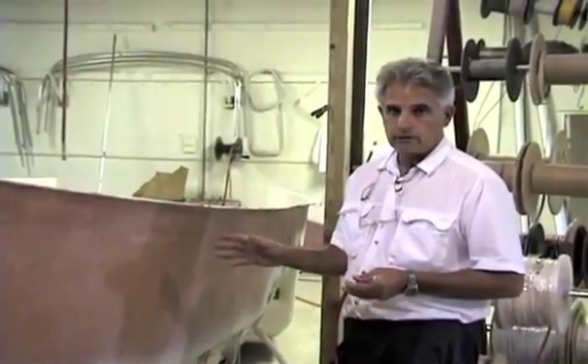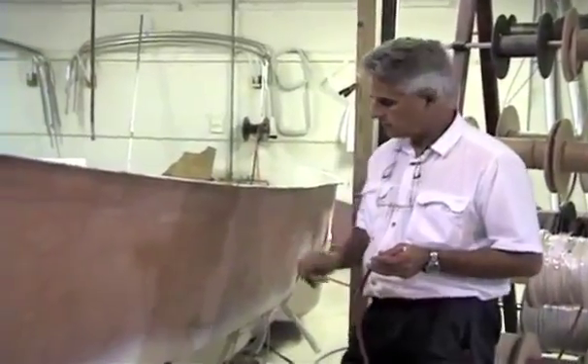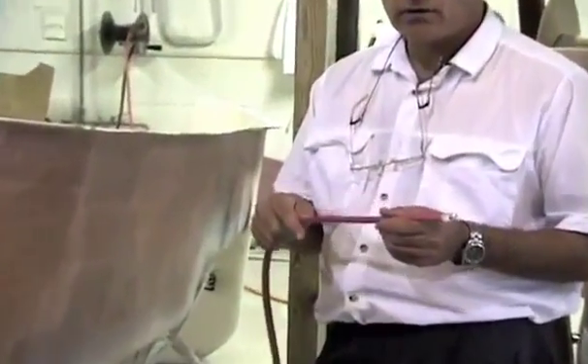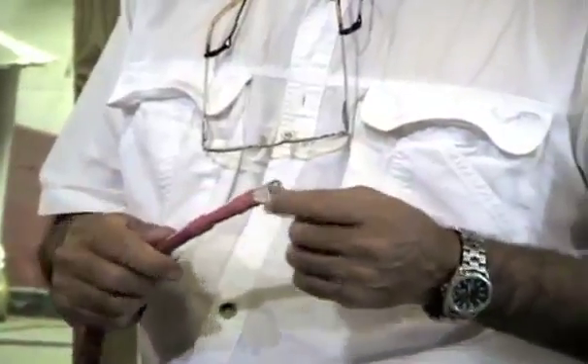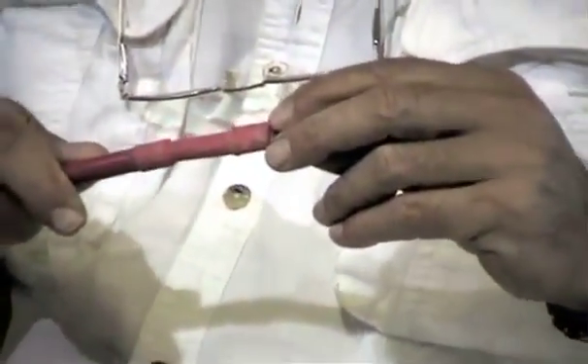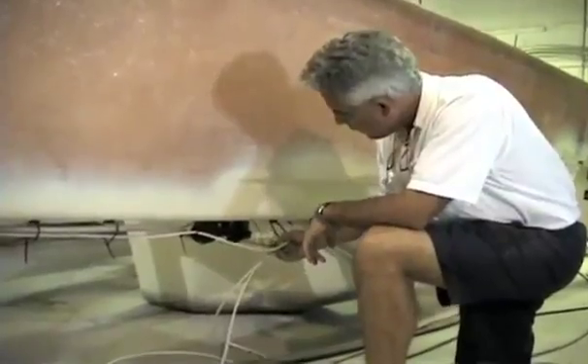While we're talking about the liner, it's a good opportunity to discuss the electrical and plumbing systems being installed right now. Every piece of wire that goes into our boat is tin-coated copper, and every fitting at the end of every wire is also tin-coated copper. This will prevent the green corrosion effect you'll see with old electrical connections in a boat. Every wire we run is a jacketed duplex or triplex wire, run full length with no connections between components.